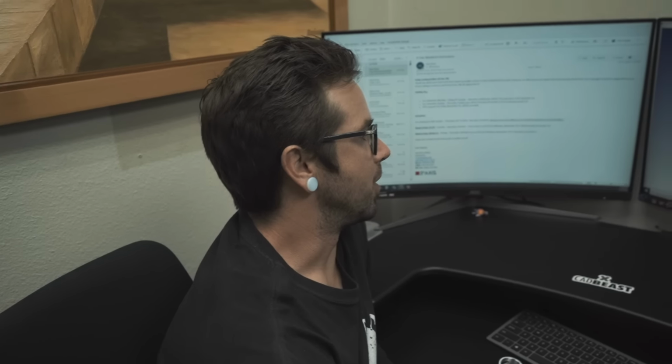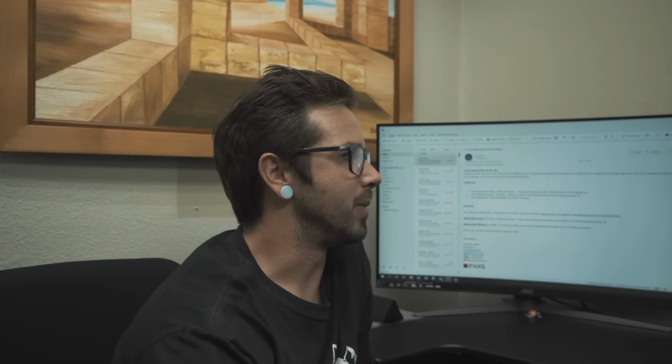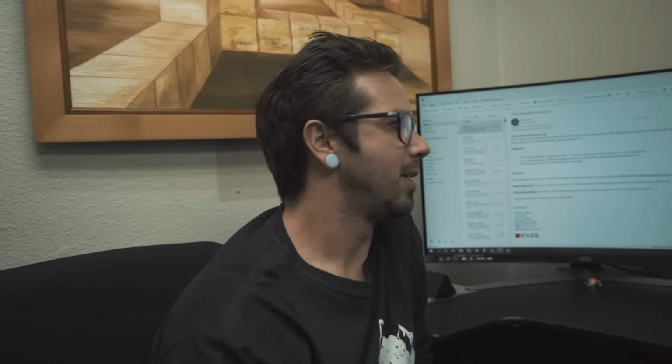Yeah, you run through the whole production program on a computer so that before even getting to the machine, you know if you're within your travel limitations or if you're gonna be crashing into the fixturing, where you have clearance, where you don't have clearance, if you need to extend your tool to find a different holder. So before we even get to the machine, we're verified knowing that we can make a good part, essentially, without any collisions.